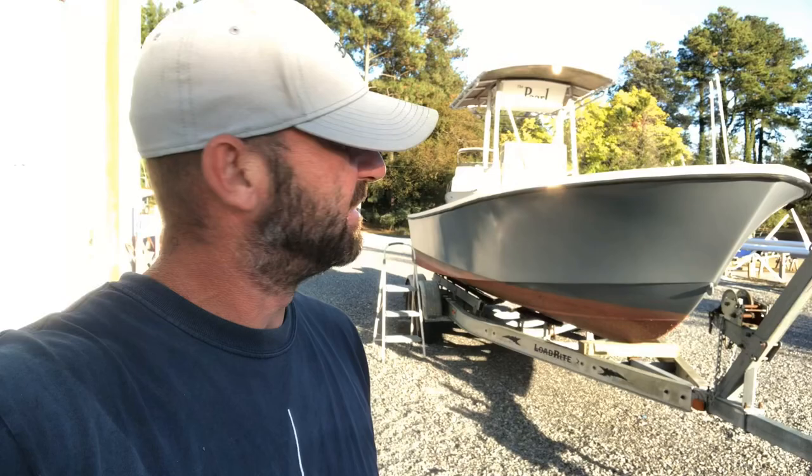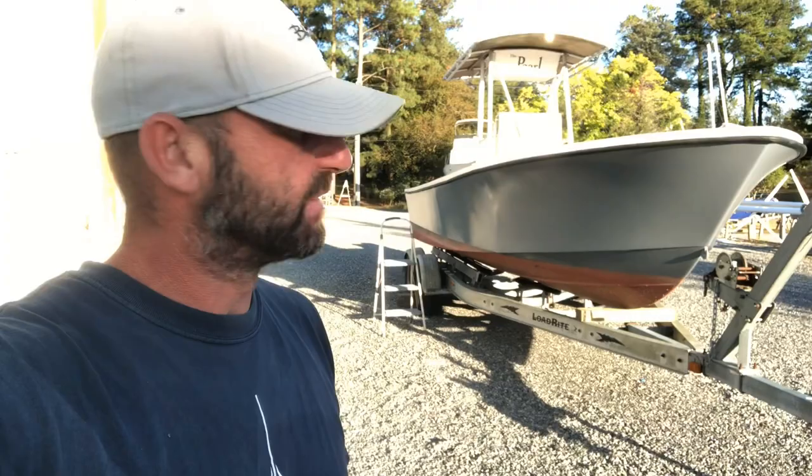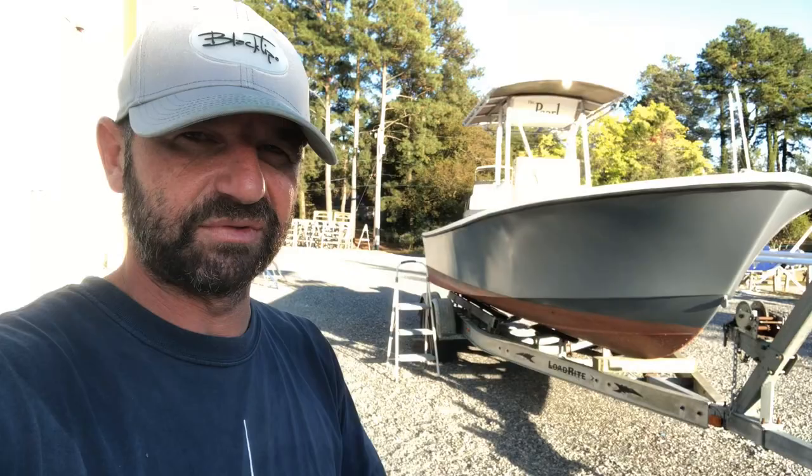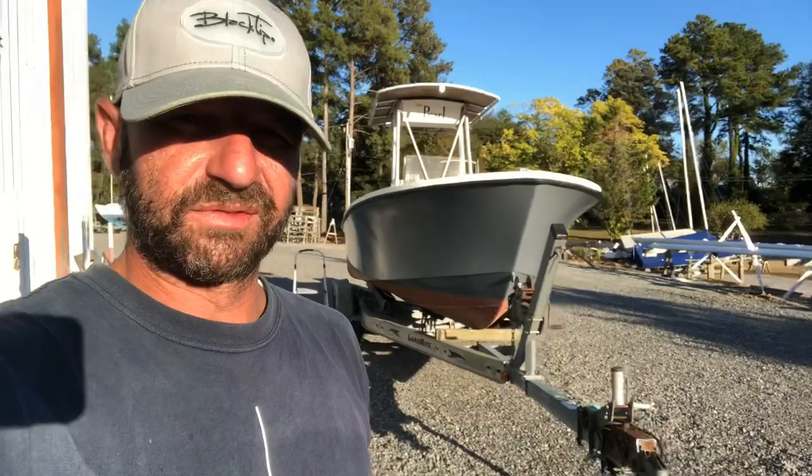It's Friday, so this will have all weekend to cure, and when I come back Monday, I'll just do a quick walk around with the 3M acrylic filler. Make sure there aren't any fine imperfections, you know, possible pinholes or light scratches, etc. And I'll jump into finish sand mode, 220, 320, Scotch-Brite equivalent to 400, and get her sprayed.